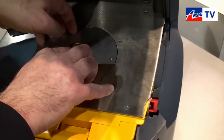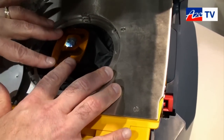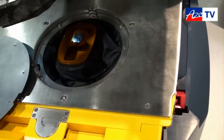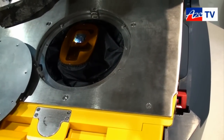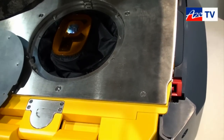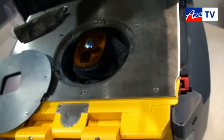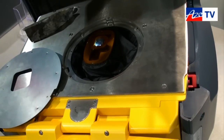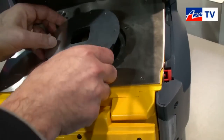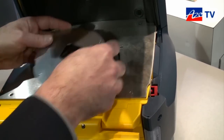We can pop up this plate over here and I can show you a few of those. First off, the X-ray measurement head is shock isolated — so the X-ray tube and the detector are shock resistant, allowing the system to be transported in rugged areas in the backs of pickup trucks without damage. Another really interesting feature is a flow-through air plenum that keeps the sensitive electronics of the analyzer completely isolated from the dust and dirt present in typical industrial and mining environments.